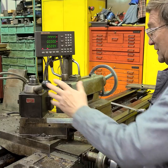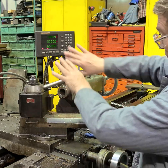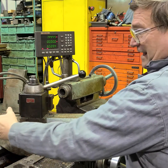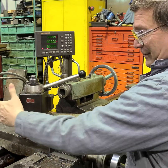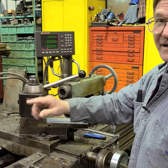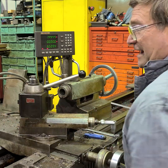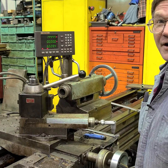But then there's another thing. Old timey, before we had a digital readout, if we came up here and got a section we're trying to thin out on a disc — where we can measure it real easy off the back side to the front side — we've taken a cut across here, and we just measured it and we know that we need to take off four and a half thousandths.